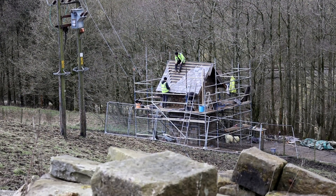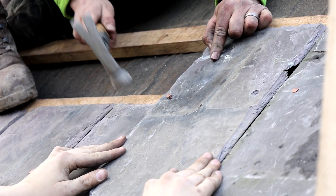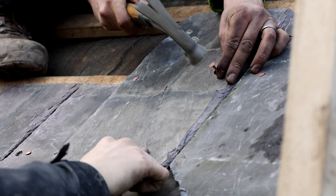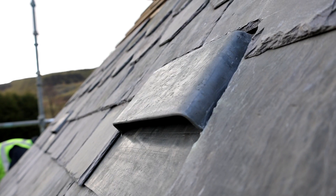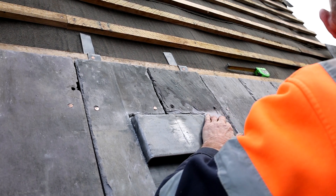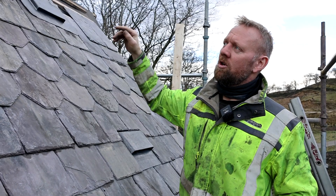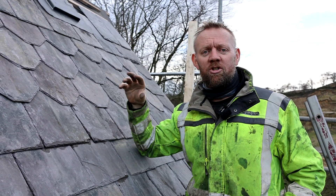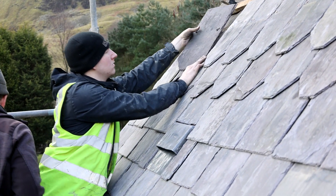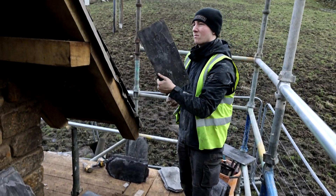We're back on the Wildlife Tower on week four now. We've had a few issues with weather — it's been snowing and raining badly over the last couple of weeks, which has delayed things. But four weeks in and we're doing fairly well — we're almost slating the roof up. We've got these reclaimed slates cut down to 18x10s and we're putting four lead bat vents in this side and four in the other. We've just put three courses of diamonds in rather than going full scallop detail, as we haven't got too much time. We've got the remaining two bat vents to go on and we're planning a lead roll ridge, probably with some scallop detail. Lads have been working hard and the weather's really been against us, but we should be somewhere near complete by end of next week.